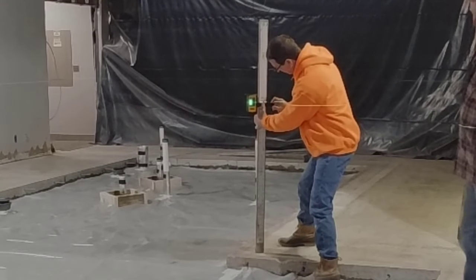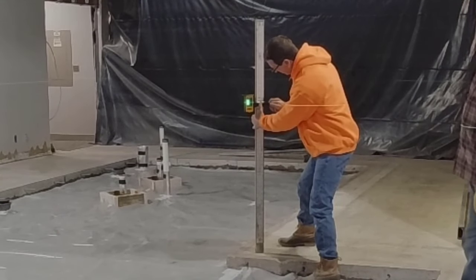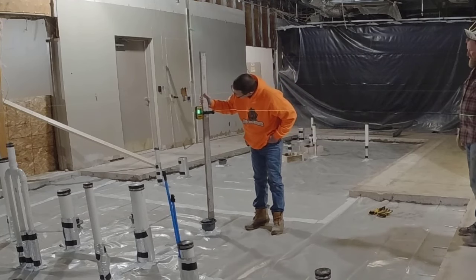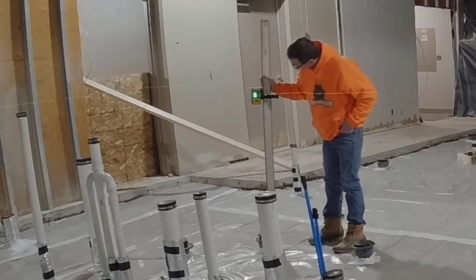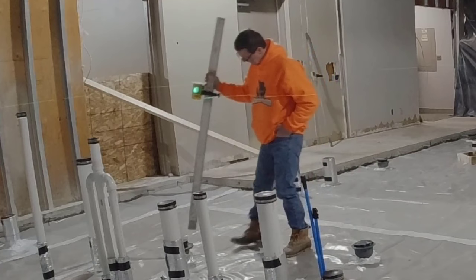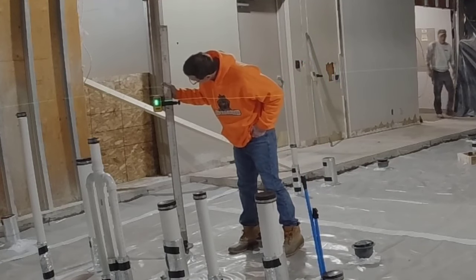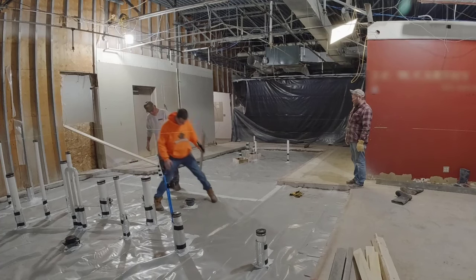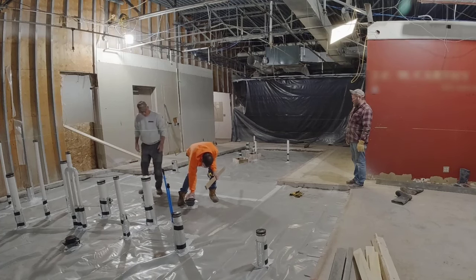We want to match this part of the floor — the old part. So I set the receiver on my grade stick right to where my horizontal line is, and then I can go around and check the different things the plumbers set, like clean outs and floor drains in here. I can check to see if the floor drains are set a little bit low and if the clean outs are set right flush with the level of the floor they want us to match.